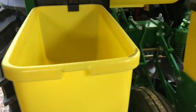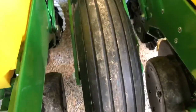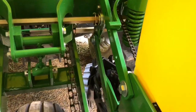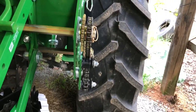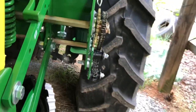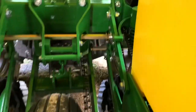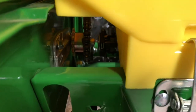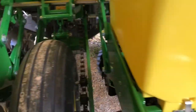With it connected and seed in the box, you take the drive tire here which drives the planter and all the mechanisms, all the chain drives. It drives your gearbox or set sprockets over here, then that shaft comes back and drives this chain, which in turn comes down and drives your meter on the bottom of your hopper.